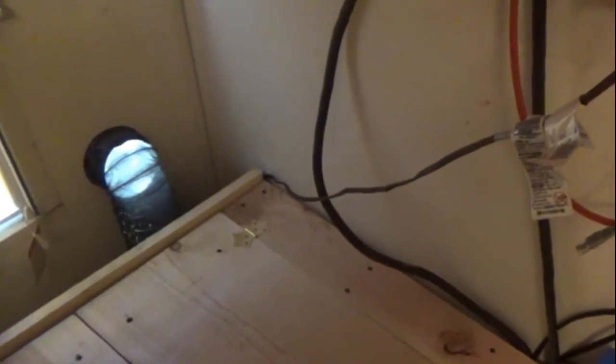The CPU fan sucks the air out of the battery box through holes I have in it and pushes it outside. That way, if there's any off-gassing it automatically takes that out. When the voltage drops below 13.5 volts it cuts the fan off. So the fan comes on at 13.8 volts and turns off at 13.5 volts — I have no risk of gases building up in there.